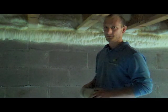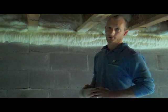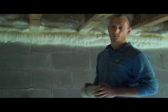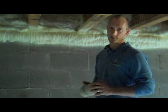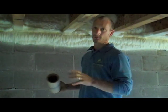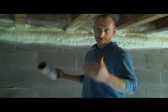The reason we want to do this is to keep out moisture. Exactly — and that's why conditioned crawl spaces are becoming more popular. Curtis, our builder here, has been doing conditioned crawl spaces for quite a while now, and that's the main reason we're seeing more and more homeowners and builders switch to conditioned crawl spaces. We have such a moisture and mold concern here in the southeast just because it's so humid. The only way to truly, effectively stop mold and moisture growth is to stop humidity from getting into the crawl space, and the only way to control humidity is to really condition the space.